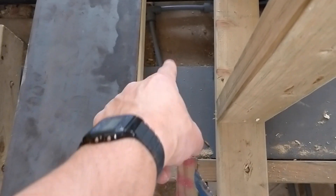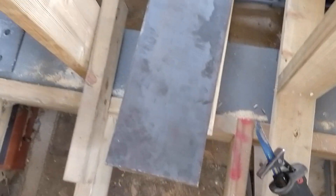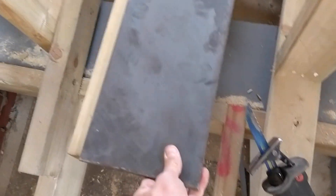We are installing the flitch plate here. What we're having to do is notching out — we're cutting just the end of the steel off that is going to conflict with the inside web of the steel there, and this will allow us to then slot the plate in.